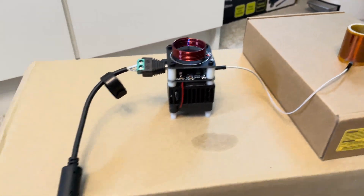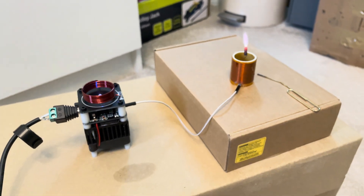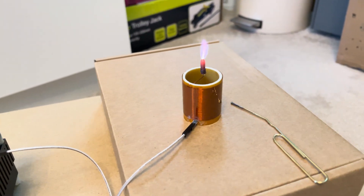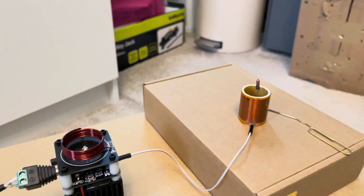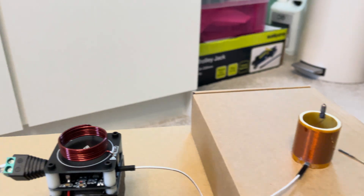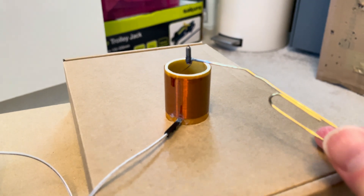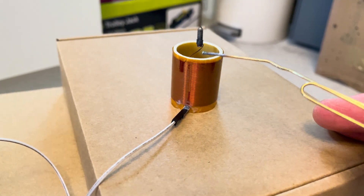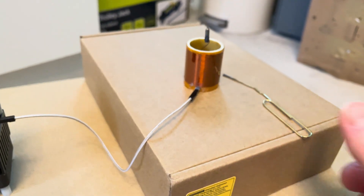We can see the electrode is now glowing red already because it's so hot that the electrode itself glows red hot — that's also why the windings have turned black. Let me turn this whole thing off because it's getting really hot now. You see that LED is red. The windings down here that hold the electrode in place are actually the same copper windings that wind around the cylinder — they were the same color as this one here before, but after using it for just a few seconds the windings went up in smoke as the enamel burned off, and that's why it's now black.